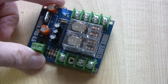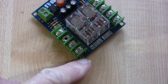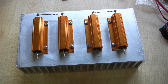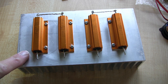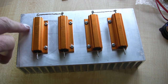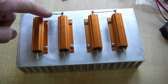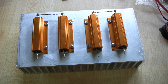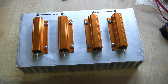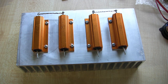There is one other issue I'd forgotten - you can't actually mount the board because the holes on this side are too close to the terminal block. On a lighter note, the resistors I showed in the previous video are now mounted with M3 screws and silicone grease under each one. You may notice the linking wires - these are four ohms each - are bare and not insulated. That's done purposely because it's very easy to hang scope probes on there. We're only dealing with low voltages so it doesn't really matter.